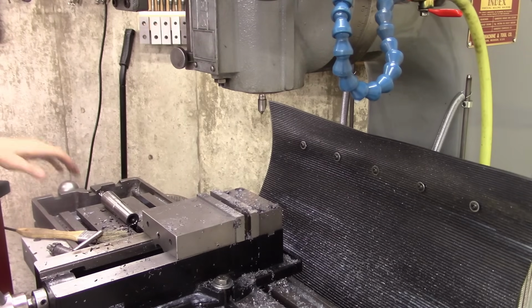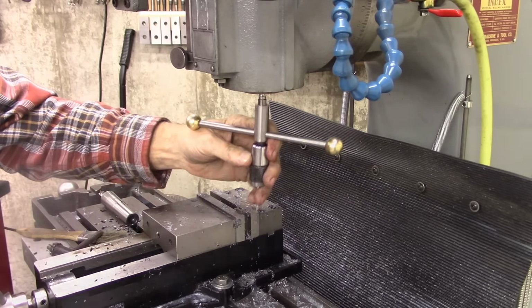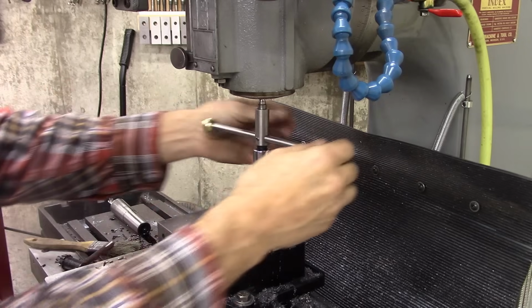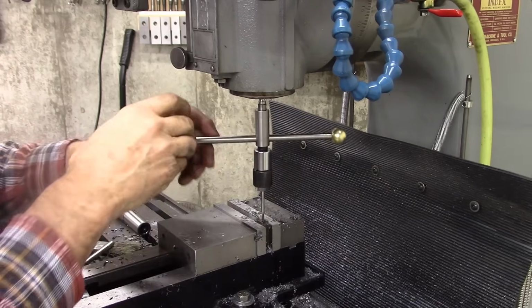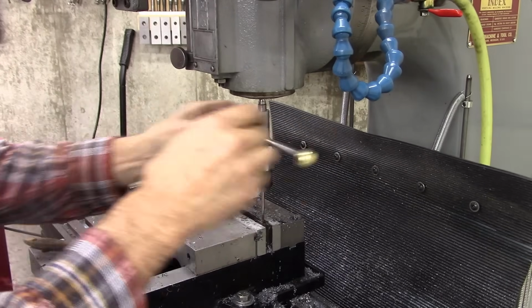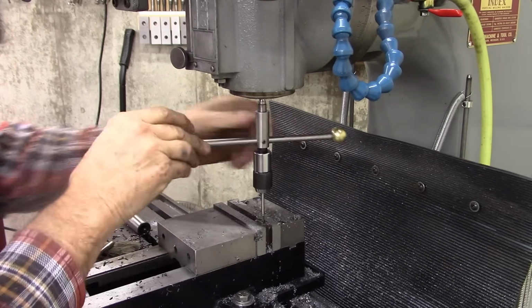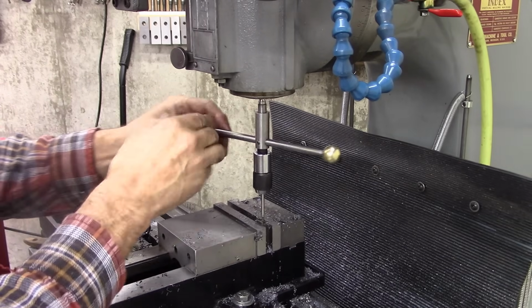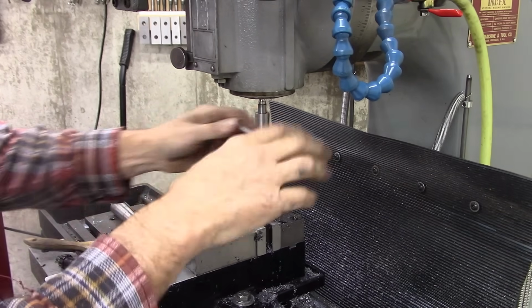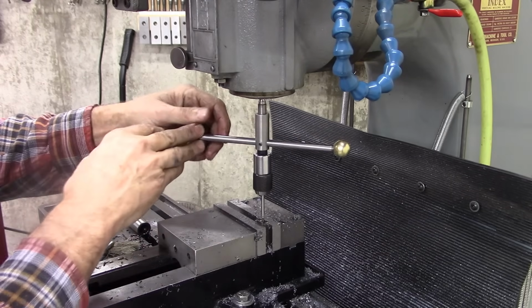Okay, I've got the countersink in there, which is for my tap guide. This is a spiral tap, a gun tap if you want to call it that, spiral point. It's pushing the chips to the bottom of the hole, but I made the hole extra deep. Super important with a tap this size that you guide it, otherwise you'll break it. Starting to get tight there.